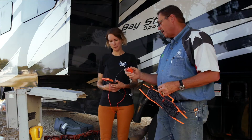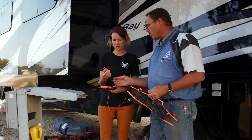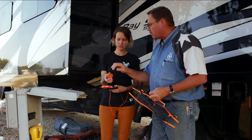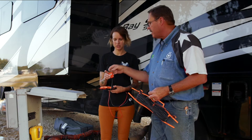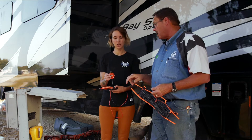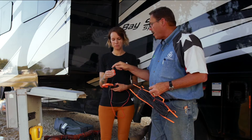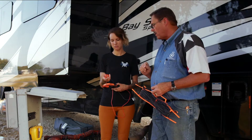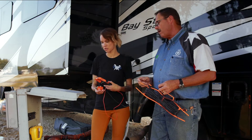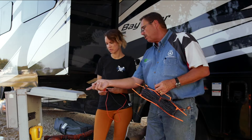This unit we made is just a plug from one of the big box stores. We took a wire and hooked it only to the ground — see that little prong right there. These other two prongs are just there to keep the plug in its slot; they're not connected to anything. All we're after is this ground right here. We're going to plug it into this pedestal, which has a ground fault circuit interrupter receptacle, and we're just after the ground.